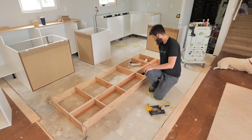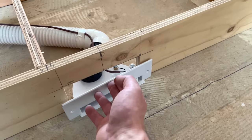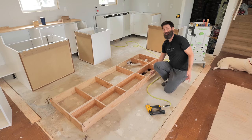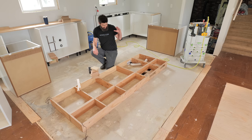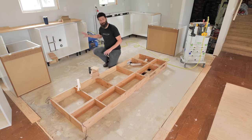When it comes to cutting things out, we cut out a couple of grills for the return air, and over here we cut a little section for the vacuum pan. It's no worries to cut things out in terms of structure, because as we go along you'll see how we're going to support everything and level it out. When it comes to getting this thing level, it's always nice to keep the exact same height as your wall cabinets on your island cabinets. But if your floor has a giant dip or a big hump, it's okay to split the difference a little. In this scenario the floor is pretty level, so we are keeping it the same as the outer cabinets.